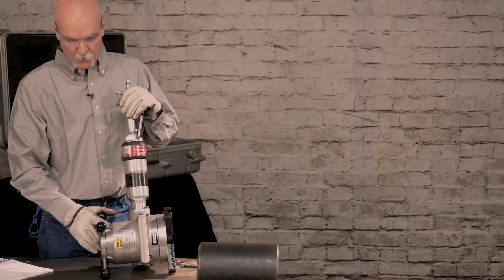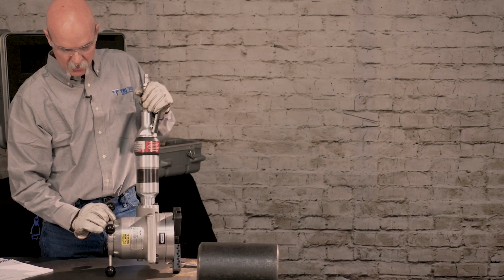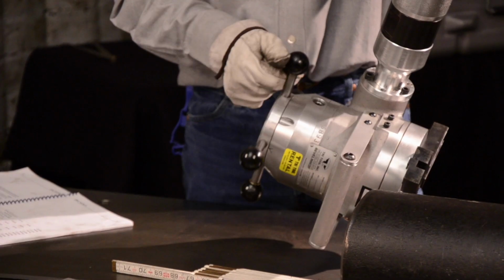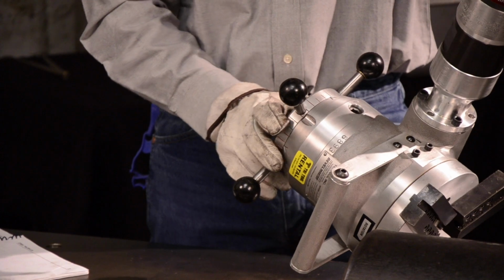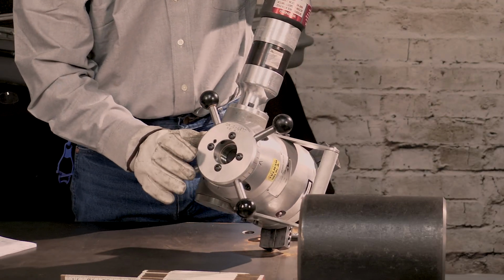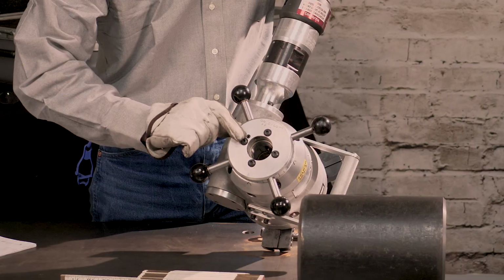Some features of the 208B are that we have axial feed graduations. That'll tell us that one full turn revolution is 83 thousandths. And then we could feed gradually, which is 0.0023. Another feature is if you're using the flange facing attachment, it actually has an axial feed lock.